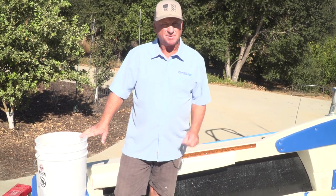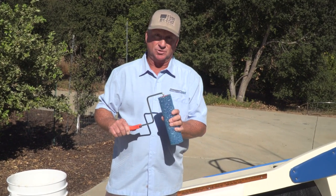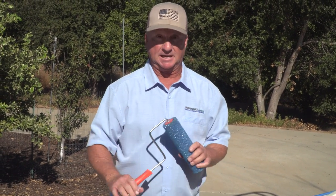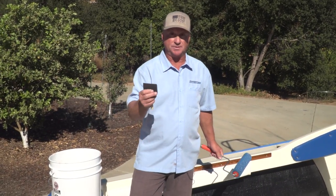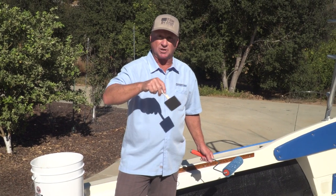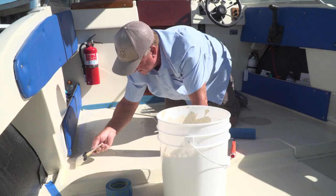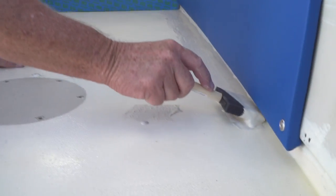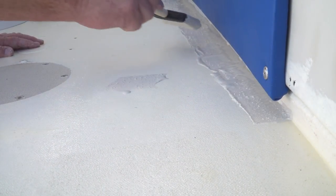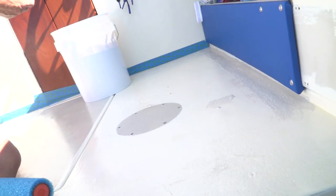With Tuffcoat in the pail, all mixed up with a little water to make it thinner and easier to use, we use a special Tuffcoat roller — you can only get these from us. Do not use a regular roller; it will look terrible. They're not expensive, just get one from us. I cut in with a foam brush — being water-based, Tuffcoat won't eat the foam. It gives you a nice square edge, almost like troweling it into corners, around pipes, aluminum tower pieces, and cleats. We put it in heavy and then trowel it out, hitting all the edges first. Don't worry if it's not beautiful right off the bat, because the second coat is really going to make it stand out.